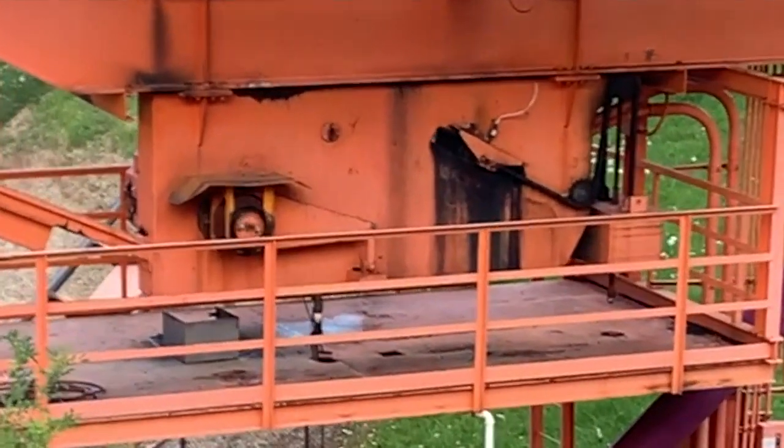So you can literally take some of these rides. I know B&Ms do this, so I'll use them as an example. And you can literally lift all the anti-rollbacks up into the train and stick them there. Put the train on the lift and stop, and that train will just stop right there, and it will not go anywhere, even though the motor doesn't have a brake on it, because the Sprag is locked at that point in time. It's preventing the chain from rolling backwards.